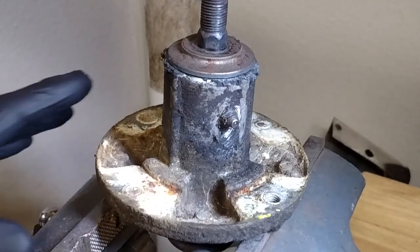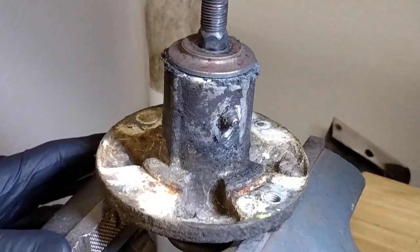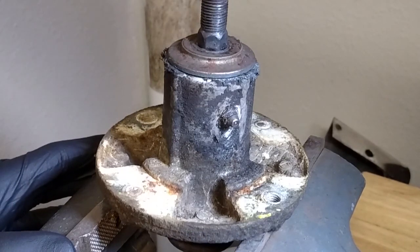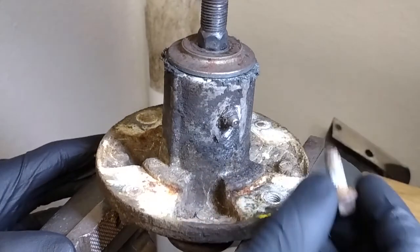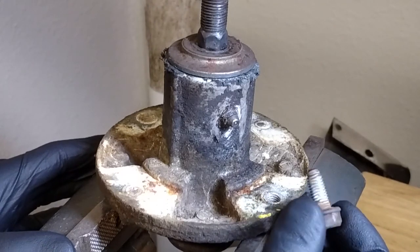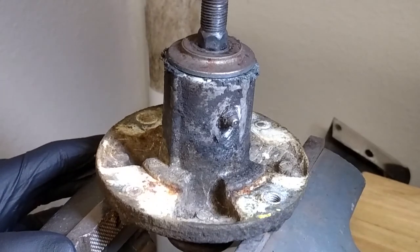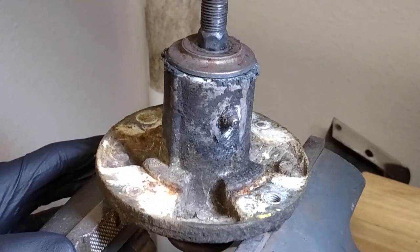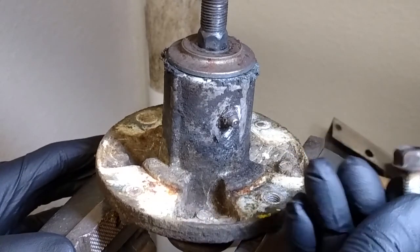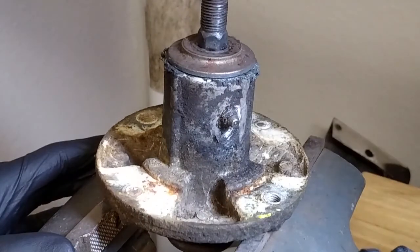At the end of the last disaster, I went ahead and busted off two of the four bolts. Looking back, it was no wonder I broke them off. These are self-tapping bolts. I don't think any amount of care I put into it would have saved them. The impact wrench certainly didn't help, but I don't think it really matters. We had self-tapping bolts in an aluminum housing that was 12 years old, so they're just destined for failure.